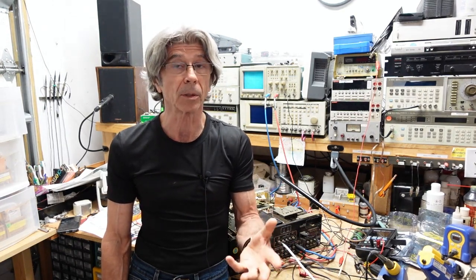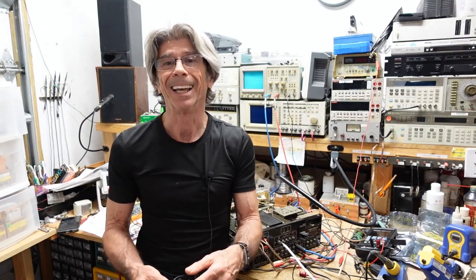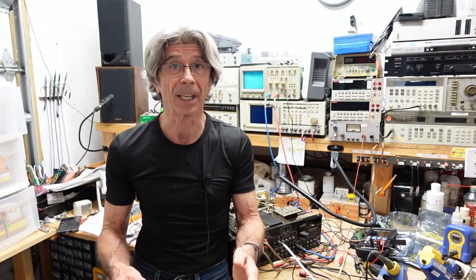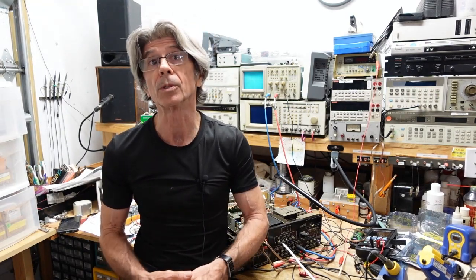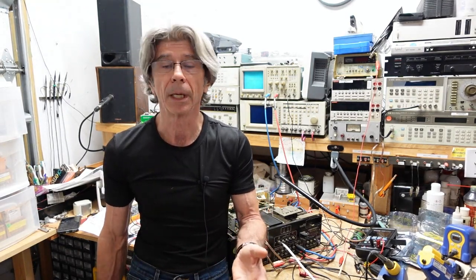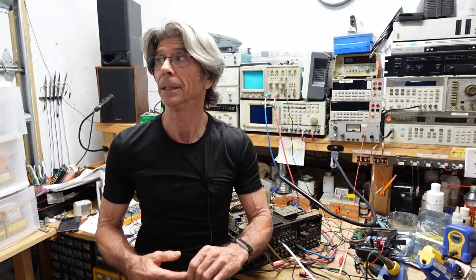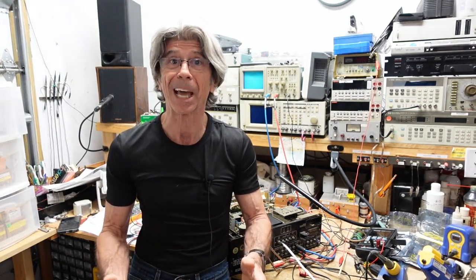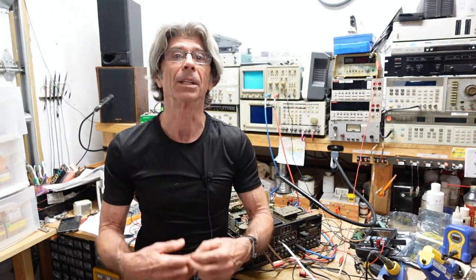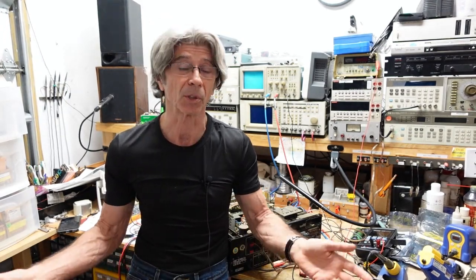But at least we get it to the point where we can energize it without any more smoke being emitted, and therefore we can then test and pinpoint any other issues we might have. A case in point was the emitter resistor that I had missed. Now, emitter resistors opening up when output transistors short is not uncommon at all. However, I haven't seen it happen to me lately. I neglected to test it. I got bitten on the hindquarters as a result. Such is life.